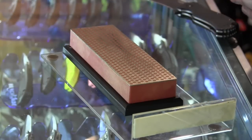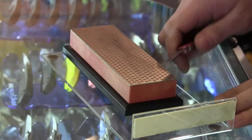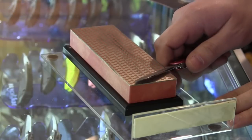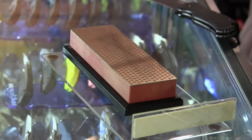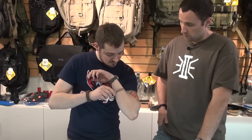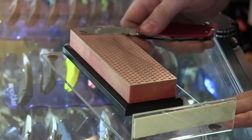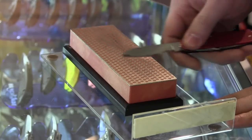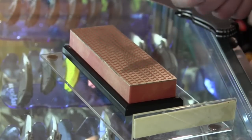When it's got a nice sharp edge and you want to clean it up, do very, very light strokes — barely the weight of the blade — to help knock the burr off and clean it up a little bit. This is just a fine-grit diamond. It doesn't take much; you're fighting against bad sharpening beforehand. It doesn't take a whole lot of effort — it takes a little bit of time, so it's mostly just patience.